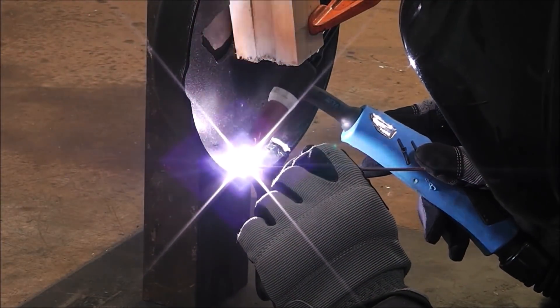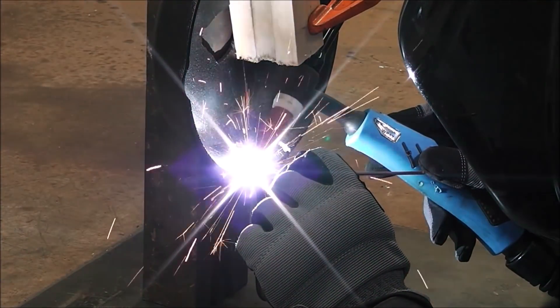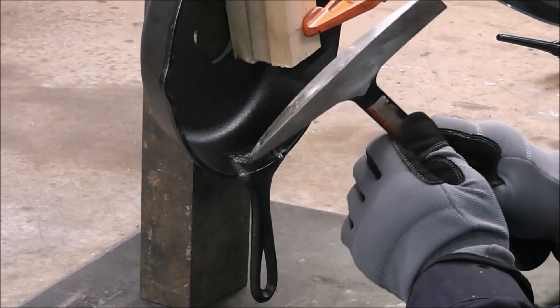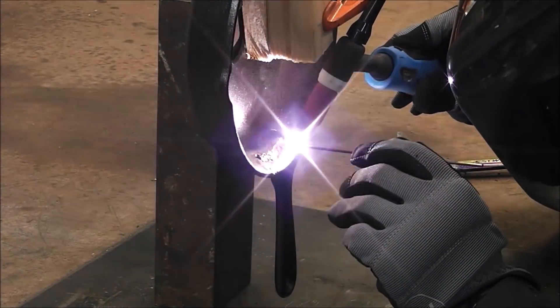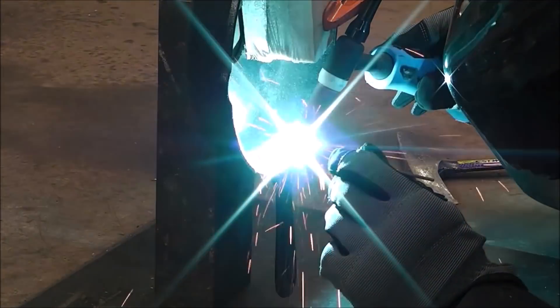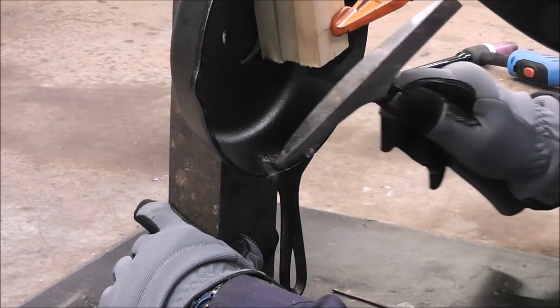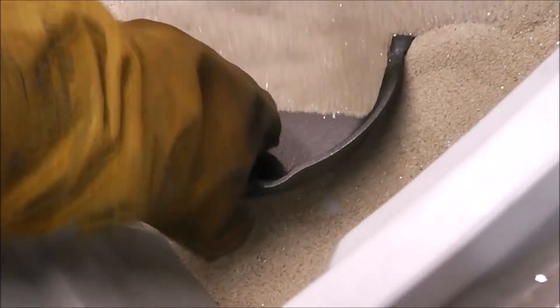I really had no issues whatsoever. You will get a little bit of porosity when you weld cast iron — it's expected. You'll see it once I grind this out: little pin holes, which is some of the trash in the cast iron floating to the top. Cast iron is not an overly clean material — it's unavoidable. There's the finished weld. Now we're going to bury it in some sand and let it sit for a while until it's completely cool.